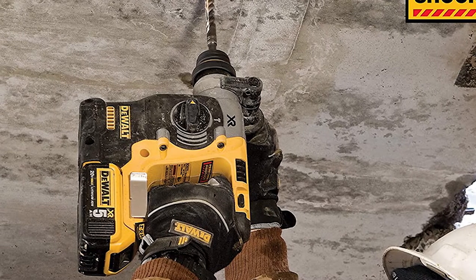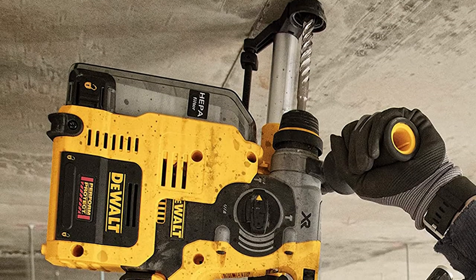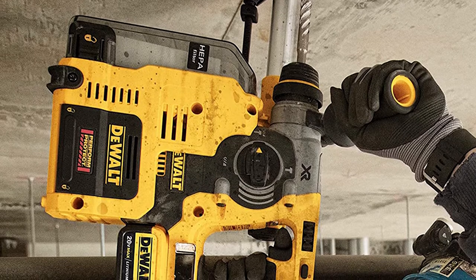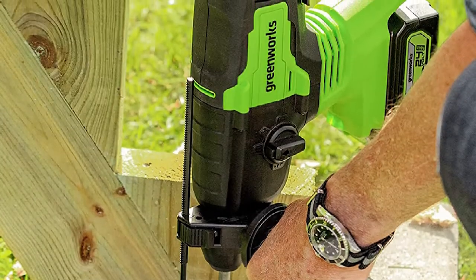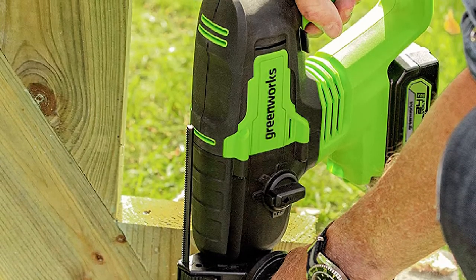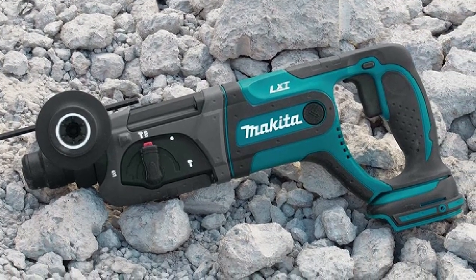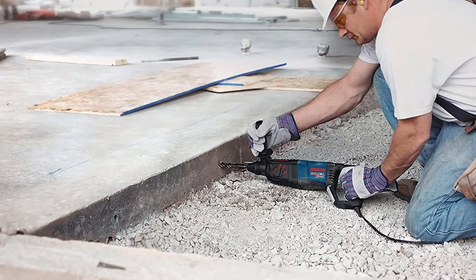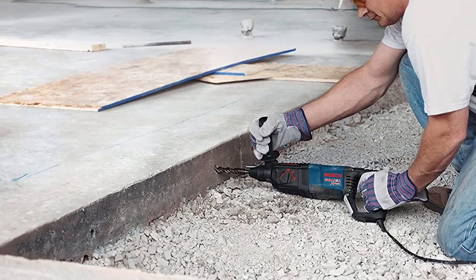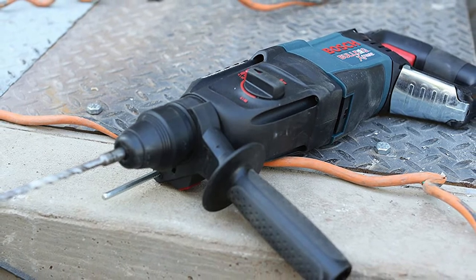Although many factors go into deciding between a rotary hammer and a hammer drill, the most important factor is the size of your project. We recommend looking at the concrete or masonry work when selecting a tool. If you need holes that are larger than one inch in diameter, you absolutely need a rotary hammer. Though these tools are more expensive and cumbersome, they are the right tool for the job. In contrast, you should get a hammer drill for anything smaller — it will save you money and arm fatigue. Most people who need to drill into concrete occasionally around the home find the hammer drill to be the superior option.